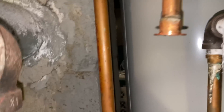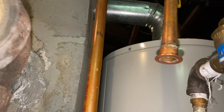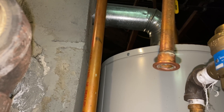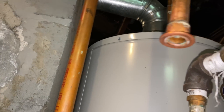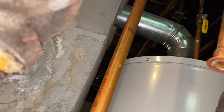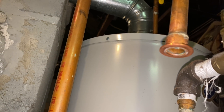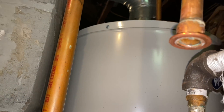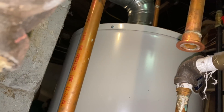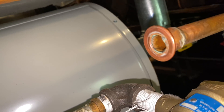I got some tools to replace the valve. It's still got a slow little drip-by — that's the cause. Another one should form because it's been about 10 minutes since I was last in front of it. It's not going to be fast, but you'll be amazed — this is the most common cause of an overfill. I can see it starting to form over here, slow and minute. If not noticed, it'll keep overfilling.